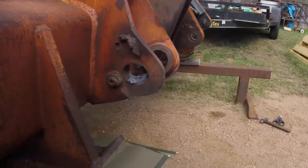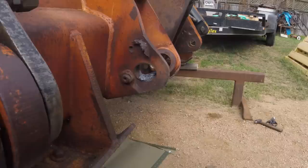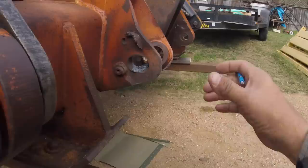And so, the customer doesn't want a line bore, which is bothersome, but I think I can get these pretty close with a circle burner and then polish it out with a grinding stone or so, and that way it lines up real nice. And I'm not happy about it, but he wants to save money, so, all right, whatever.